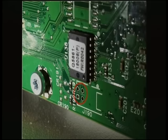So 5 minutes later, I have the lid off, and there's a space here. So as good hackers, we should be suspicious of anything that's not used in the final product. Especially also, this projector's kind of poor, but there are two resistors mounted here. Resistors cost money. So no one's going to put these resistors on there if it's genuinely unused in this product. So something has at one point probably plugged onto this, and it's a test port. So three or four pins, have a look out for these things: ground, send, receive, and sometimes power. You'd be surprised what's listening on them.